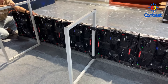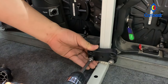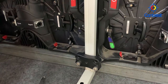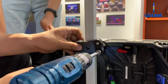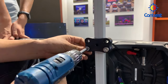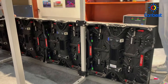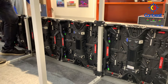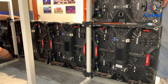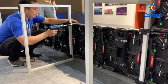This is done. One important point to note: when there is a leveling beam at the bottom, you need to fix the connecting plate at the bottom as well — this is very important. If there is no leveling beam at the bottom, it is not necessary to fix the connecting plate at the bottom line. When installing the first bottom line of panels, please make sure to check the details after finishing the first line, to verify that the connecting plates are connected properly.